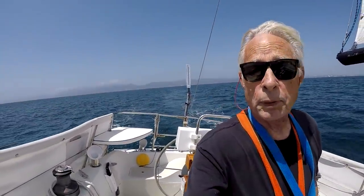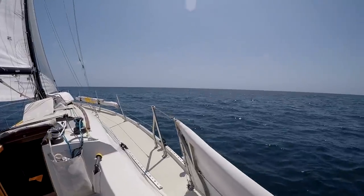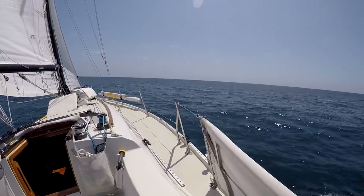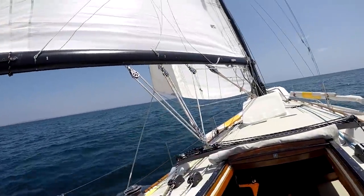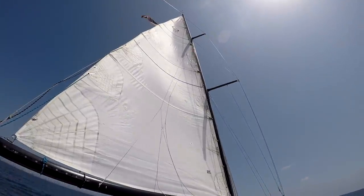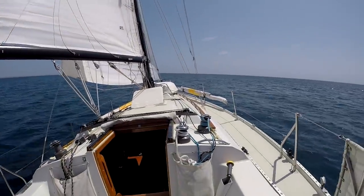Here's a wind vane performing pretty much the way it should. It's more or less straight up and down, and we're sailing along nicely to windward. We have 14 knots over the deck — that means probably 10 or 11 knots of wind, and our boat speed is 6 knots. The mainsail has a bit of a luff in it. Wind vanes are very sensitive to sail set. If you were steering by hand, you would probably trim the mainsail more, which would make you heel over more, which would make the rudder work harder — and it's a good question whether you'd be going any faster.